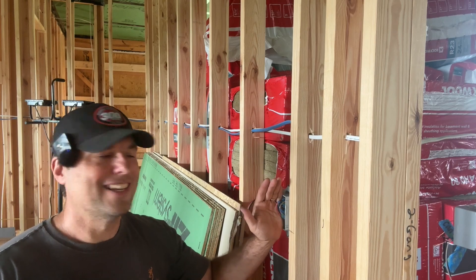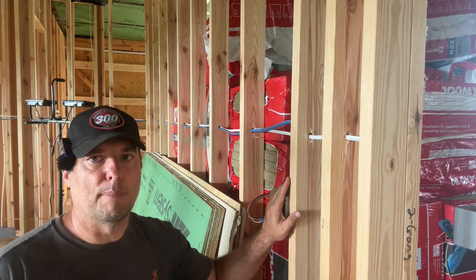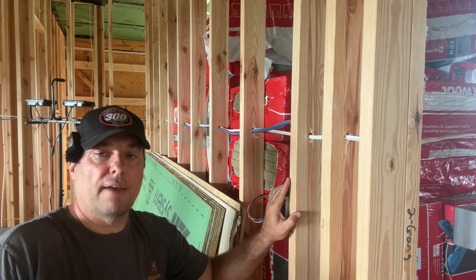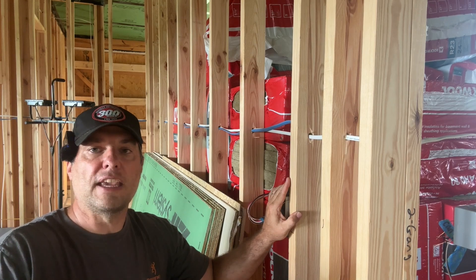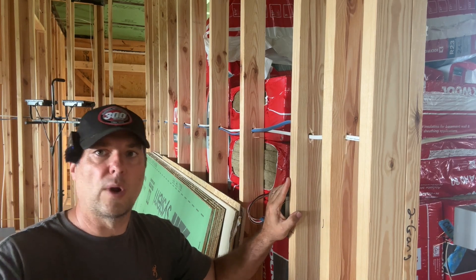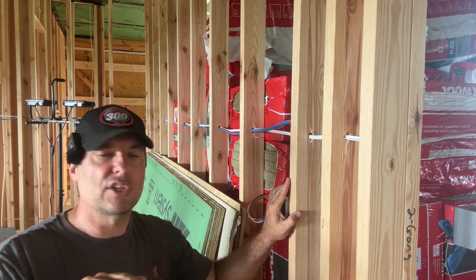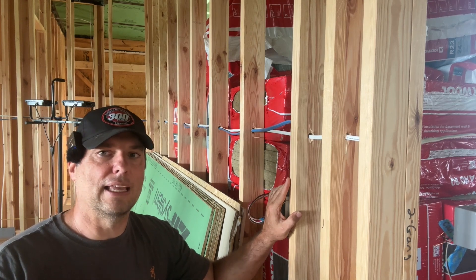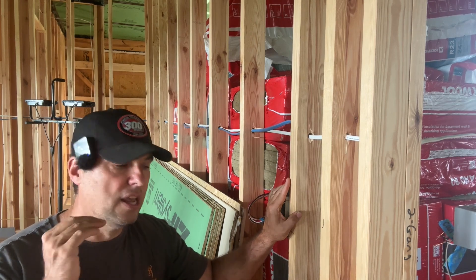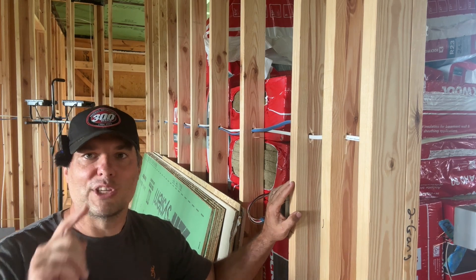Hopefully I'll remember how this is done, and it simplifies the setup inside the box. If you haven't watched the video prior to this one for the rough-in, I'm keeping that same theme through the whole process — power goes to the switch first and then to the fixture. That's the way it is in every scenario in our build, and that helps me if I ever have to come back in later to work on things, because I know where that power is coming from. That's all I have for you today — we'll see you on the next video, thank you.